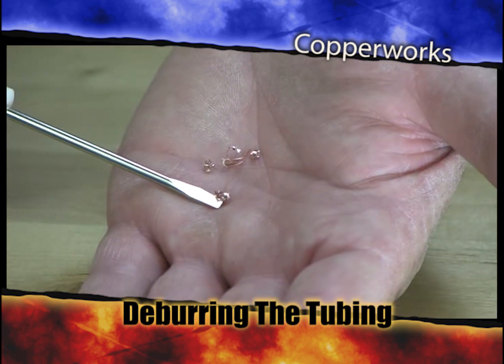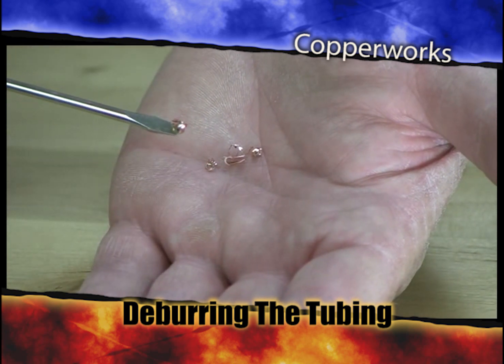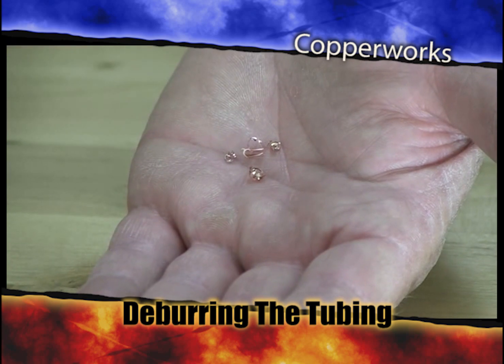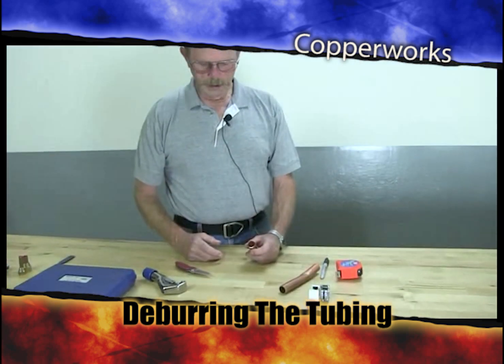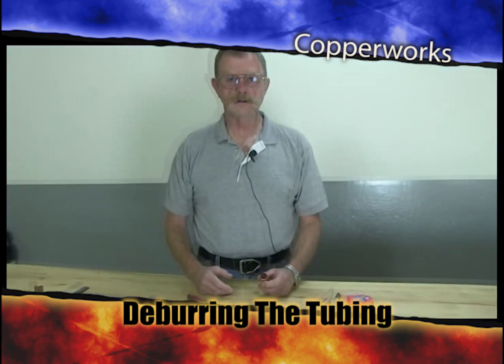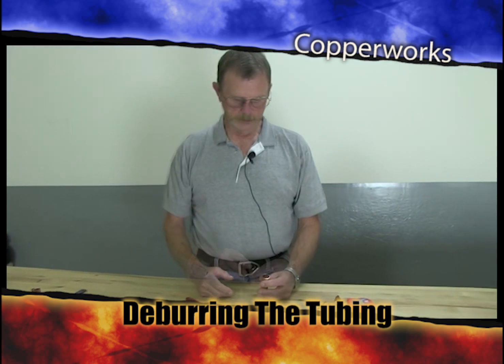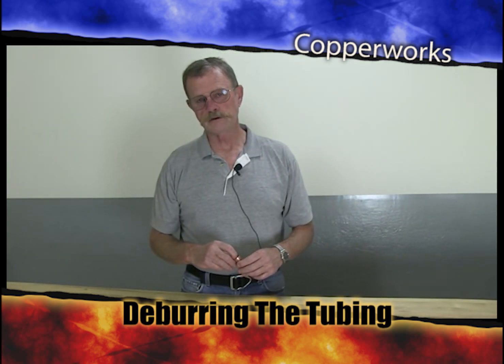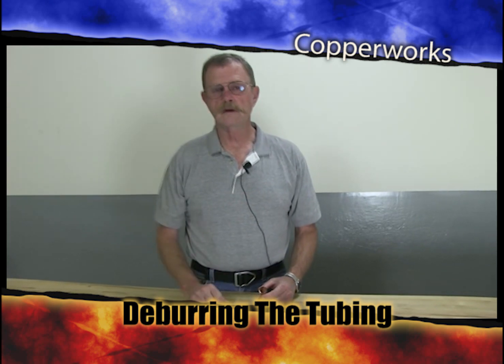I'll tell you what will happen with this little piece of copper. It'll either get caught in a filter dryer, or a screen, perhaps in the entrance to the metering device, or worst case scenario, it's going to get hauled into the compressor. If it's a hermetic or semi-hermetic compressor, it'll get into the windings of that compressor because, as you might know, or maybe you don't know at this point in time, all the suction gas goes back to the compressor.